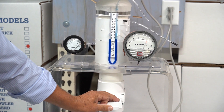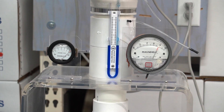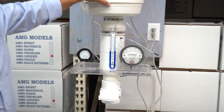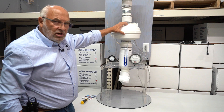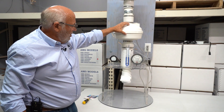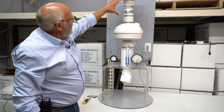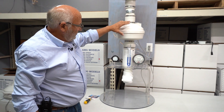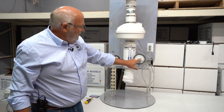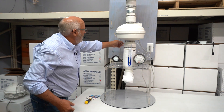There you go. Now you've double stacked two Eagle fans, in effect doubling the pressure. You've gone from four inches of water column to eight inches of water column, which should very much increase your field of extension. So it is a general rule that double stacking fans will double the pressure — evidence is right here. And airflow will increase around 50%.